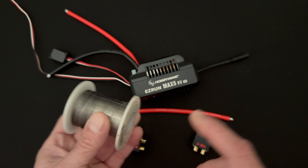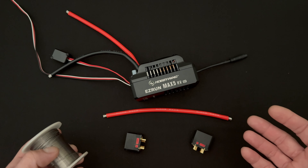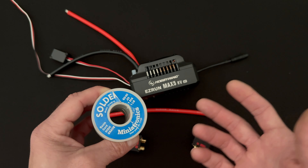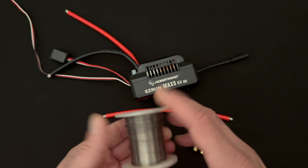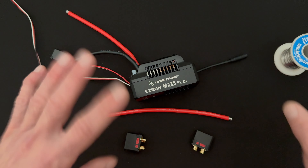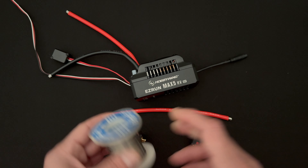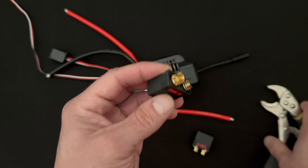The solder I use most of the time: when you run in to get solder, you'll likely get lead-free solder, which is fine - just make sure you also get some flux paste or flux liquid to go along with it. Make sure you get electronic solder, not plumbing solder. Rosin core is what you want. Leaded solder is pretty hard to find these days - my local hobby shop still carries Minitronic - but leaded solder is being phased out of electronic production internationally.